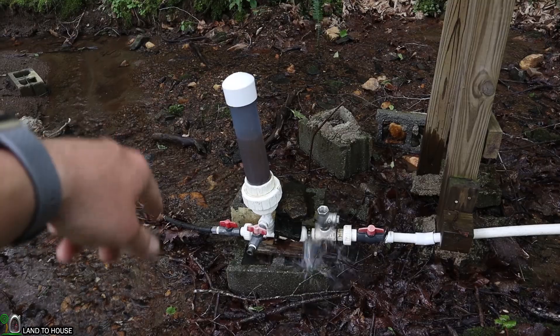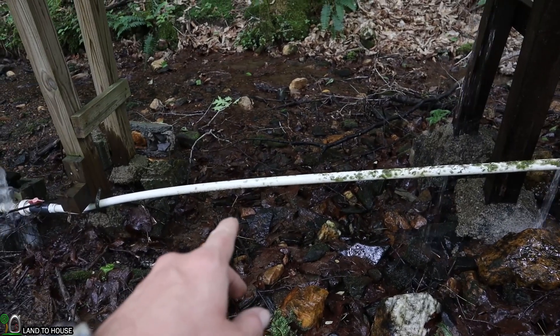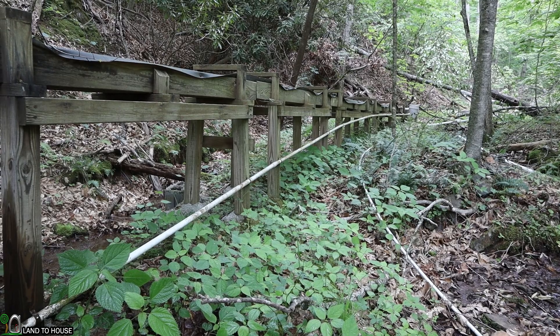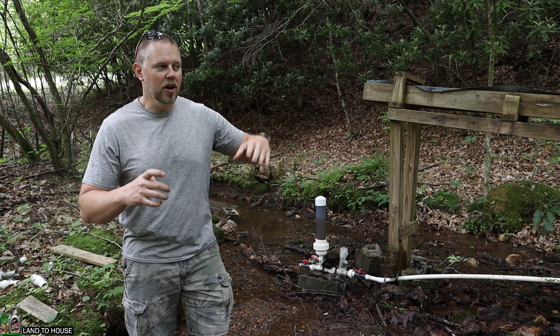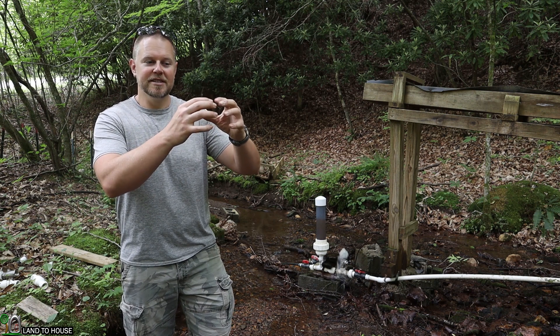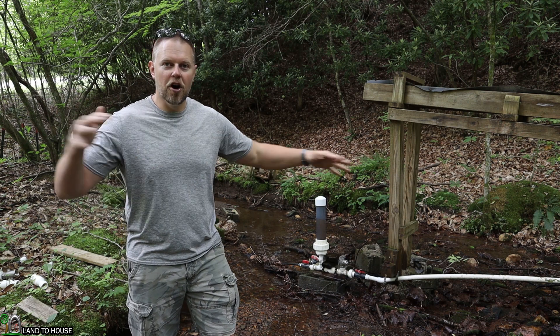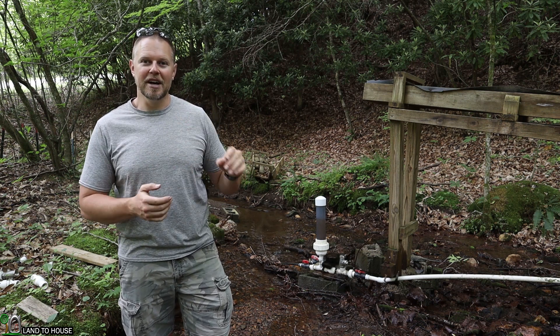Now that I have an air cushion in the pressure tank, let's take a look at the hitting hard effect. That delivery pipe is not bouncing whatsoever — no bounce at all. And over here on the drive pipe, no more bounce there either. You can no longer hear that hitting hard sound as it travels up the drive pipe. So if you have a ram pump and you notice that the delivery pipe is bouncing and the drive pipe is making a cracking sound and also bouncing, then you probably have a waterlogged pressure tank — that's where the air in the pressure tank has dissolved over time into the water, and basically it's just full of water. So every time that pressure wave or water hammer hits, the whole system jars. The air pocket in the pressure tank acts as a cushion so there is a little bit of give every time that pressure wave hits.